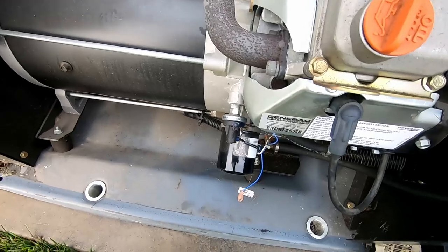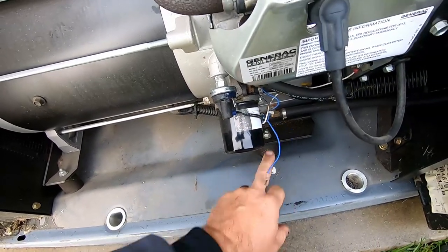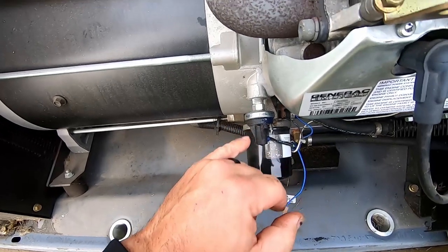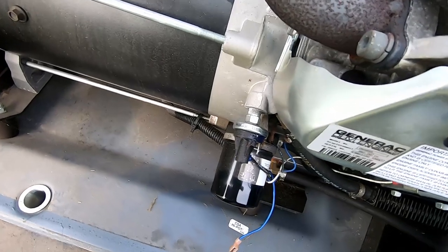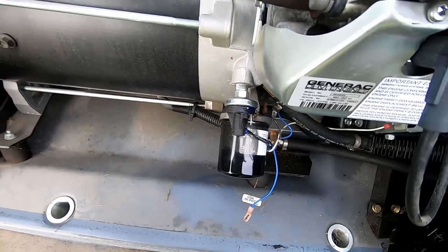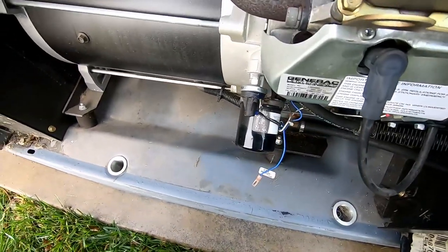It ran the whole time until I decided to ground it out. Zero is always your ground, so I went ahead and grounded it to the stud there, and it did work. My question is: did we have a pressure switch that did not open like it's supposed to? If I remember correctly, it starts out grounded when it's not running, and then once it builds pressure it opens the switch, removing it from ground, which then allows it to run.